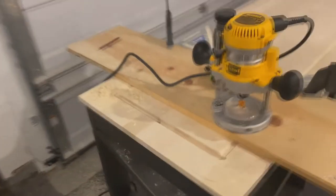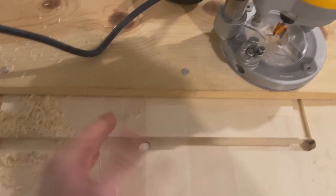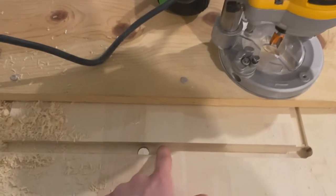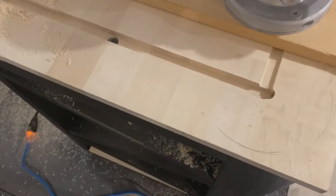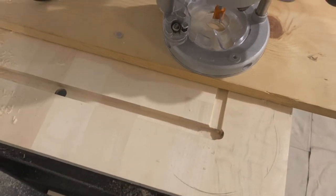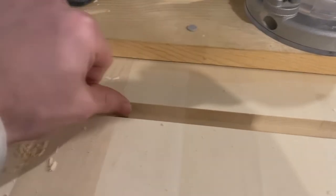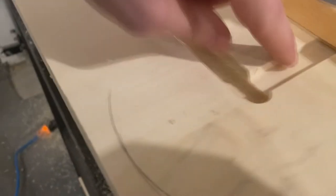But so the reason we're having to do this is I went ahead and I cut the hole to drop the LED wires through. And then when I tried to run them through the channel here before setting the epoxy in, trying that tonight, I wanted to originally lay the LEDs down flat and then just have them go around. But I think I knew this wouldn't work and I was just banking on some miracle. But they're like too thick to wrap around this corner, essentially. Like, I'll show you when I go to put them in finally. But so anyways, that's kind of a mistake. Or not a mistake, but just a problem. And so what I came up with doing is I'm going to lay them flat against this edge so they kind of shine towards the other edge. And so to do that, I had to deepen this channel by about another quarter of an inch so that the LEDs can run along that because it's just not deep enough here.